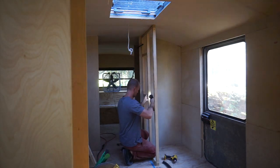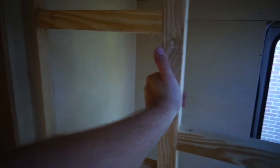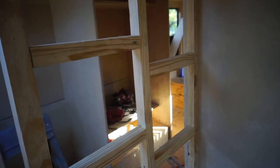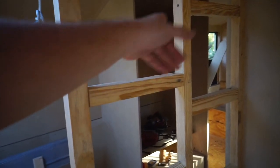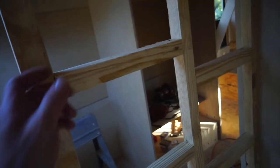Okay, well that's done. It took me like three hours to do this wall and it really didn't seem that stiff — like, if I'm gonna build a wall out of studs it better not be able to move. It's good here, but I just started making a freaking ladder out of it because I just wanted it to be stiffer. I think next time all these things are pocket hole situations — like why not just put two pocket holes per piece, bam bam.